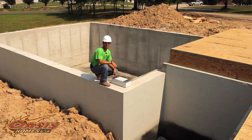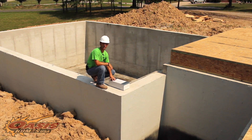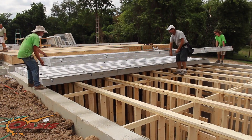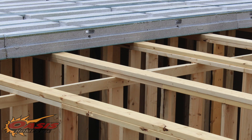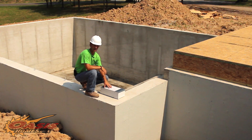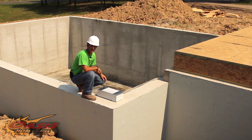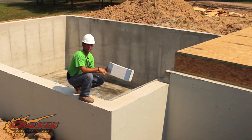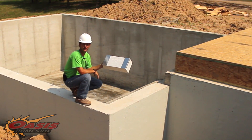This garage floor is probably one of the most exciting parts of this whole project for me. We're going to have 12-inch filler panels made of steel and foam running north and south on top of the floor, and we're going to have temporary wood framing walls running east and west to hold up this floor until the concrete cures. So we have a 12-inch foam panel with a 6-inch concrete floor going on top of it, sloping 3 inches from back to front. When you remove your shoring, what you'll see from the theater room is a foam ceiling with steel studs already ready for drywall, with an R-50 insulated volume.